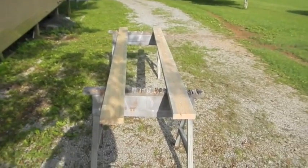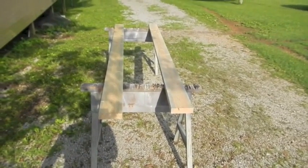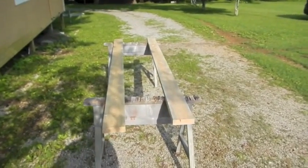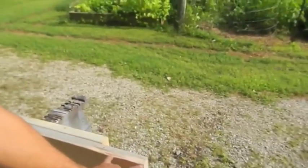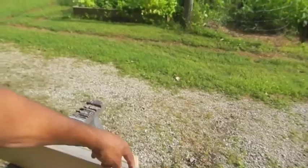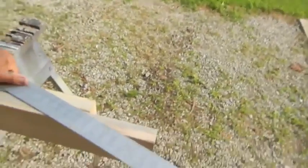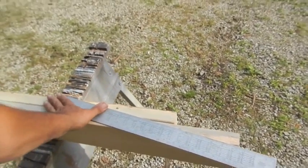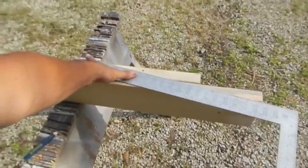I'm going to put them together and give them a little scarf joint at this point, and I'll glue them together with PL Premium. Scarf joint — six-to-one ratio. Start off at this point, come over six, go up one. Now I'm going to take this square, lay it across right in there like that, take a saw, and cut it off.